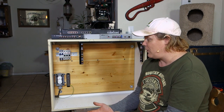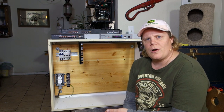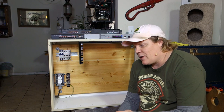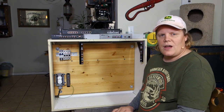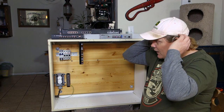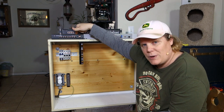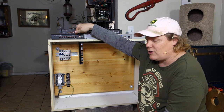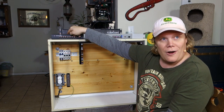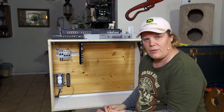You can run all your different voltage devices, whether it's Ubiquiti which are 24 volts, or the Mimosas which are 24 or 48 volts, or Cambium or other standard WISP equipment or routers. In this case we're running a 24-volt router with a head switch. We've got this beautiful little edge switch here which is going to be our PoE switch for today.